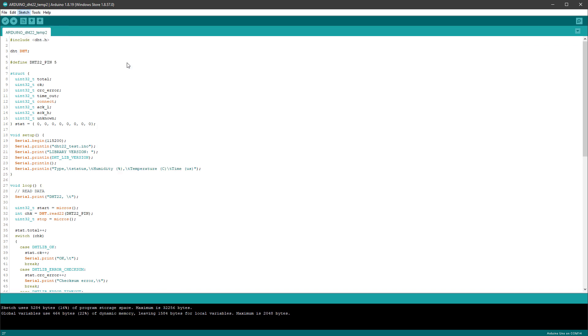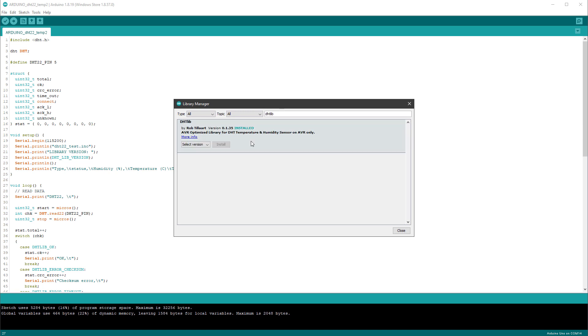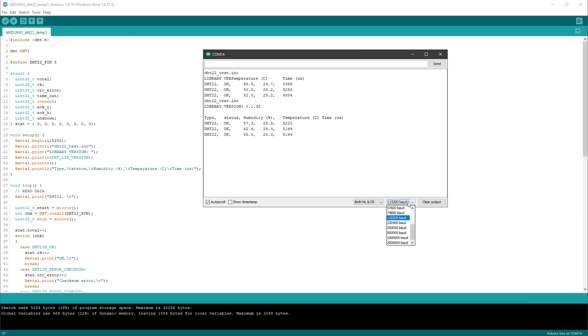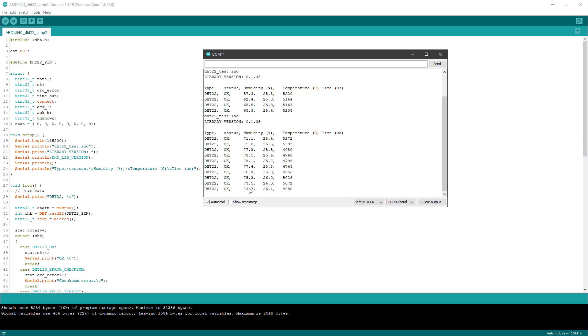I will copy the code into Arduino IDE, then go to Sketch > Include Library > Manage Libraries, type in DHTLIB, and install this library. Upload this to Arduino, open the serial monitor, make sure the speed is set to 115200, and you should see similar readings as in the Wokwi website, but now using real-world data from the sensor. The only missing piece is merging this code for reading temperature and humidity with our code for driving the e-ink display.